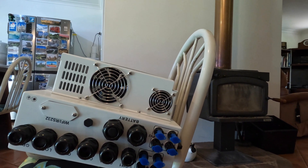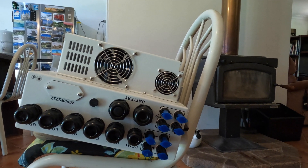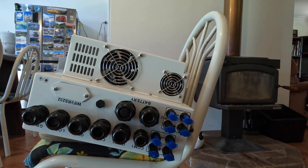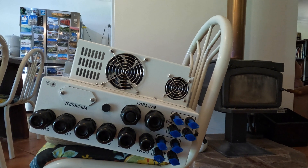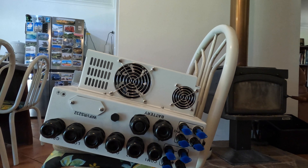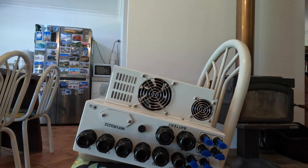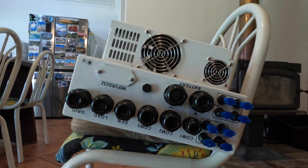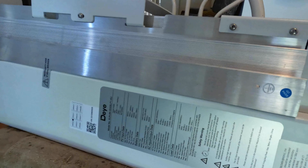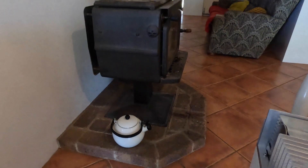Same as the solar connections. This has got two MPPT controllers in it — each controller can take two strings to a maximum of 10,400 watts. I've got 10,000 watts so this is going to be pretty well matched to my situation. It's got comm one, comm two, comm three when I get it mounted on the wall.